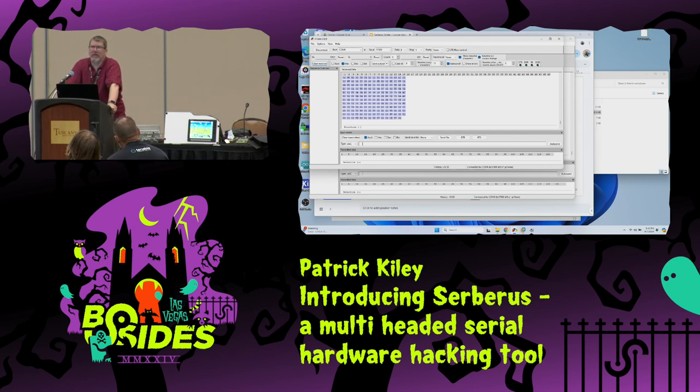Yeah, that's actually a great way to describe it. So really what that means is if you're looking at a board and it looks like RS-232, but you're not quite able to decode it, try inverting the signal. If you're looking at a signal and it looks like it's a UART signal, try inverting it. It might just be straight up RS-232. Because it's an inverted signal, zeros will appear as ones and ones will appear as zeros. And a lot of the logic analyzers won't go negative, so you'll just be seeing the positive swings on it. But it'll look like a serial signal, but it's just a little bit different.